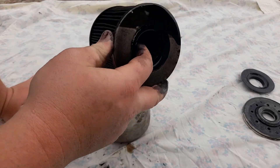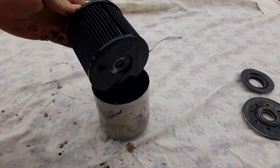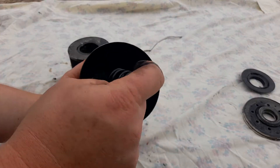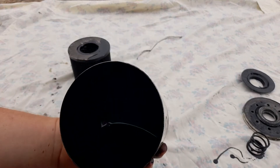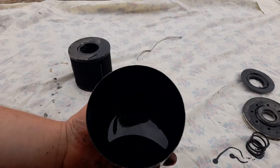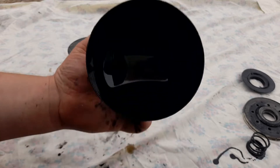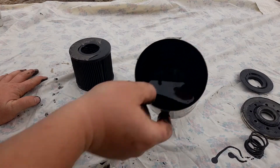Your element should just come out like that. This is the part we're going to be looking at. There's still going to be a little bit of oil in the filter so be a little careful with it. You can take a look at what's in the bottom - you probably can hardly see it, it's all just black. If you've got a major problem, with filters that have major problems you will see it - generally the first sign will be in here, because you'll be able to see shiny little metal shavings. But in this one, it's just plain black. This engine makes a lot of soot, and that's just how it is.